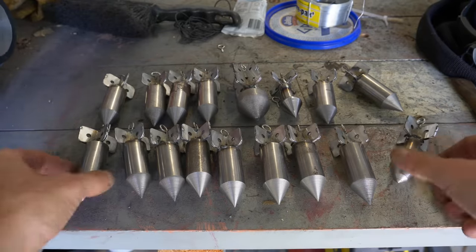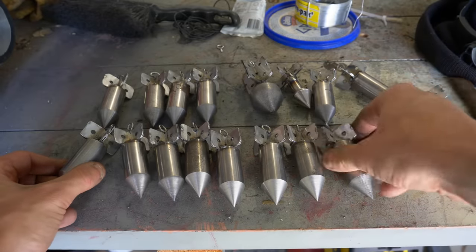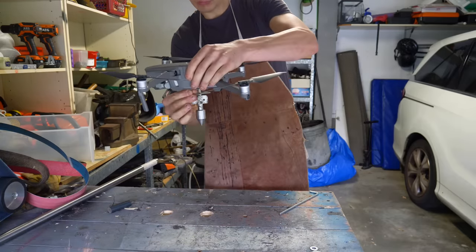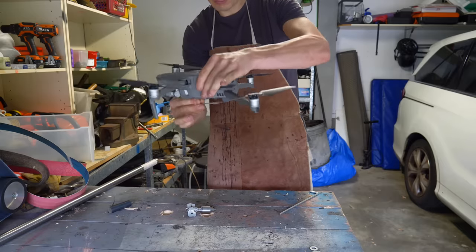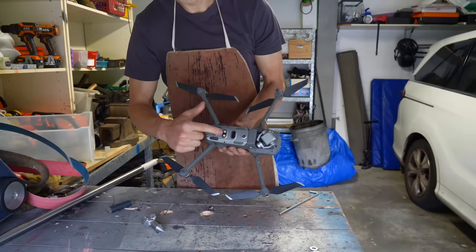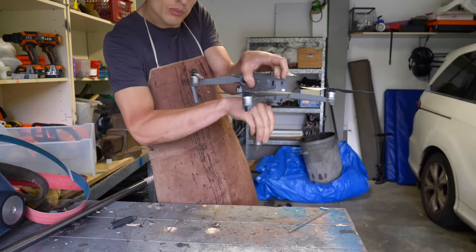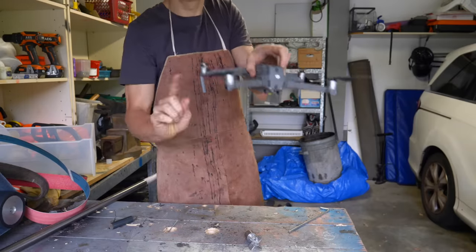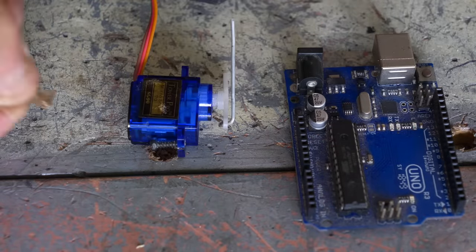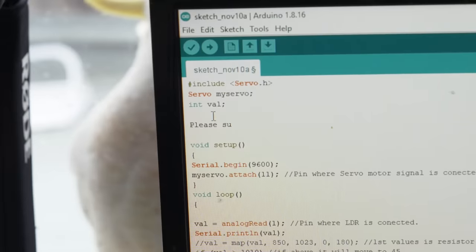After a full day of slaving away, I now have an arsenal of different sized darts, but I need a way to drop them. My first thought was to create a hook on the drone — if I accelerate the drone in one direction fast enough, the dart will just slide off. But that doesn't allow me to be very accurate. Then I realized another way: drones have the ability to turn on and off lights. So all I need to do is make a claw mechanism that reacts to the lights being turned on and opens when I want it to. To do this I'm going to use an Arduino Uno, a servo motor, and something that reacts to light. Then I just stole someone's code from the internet and modified it a bit to suit me.